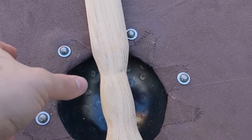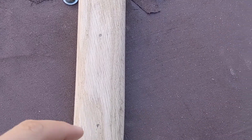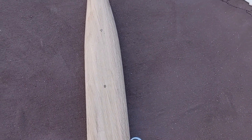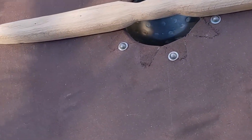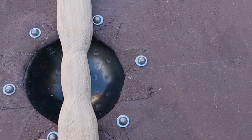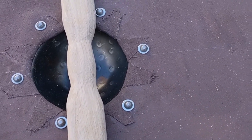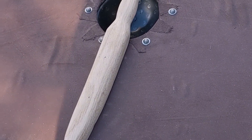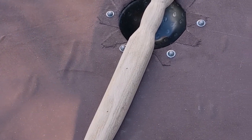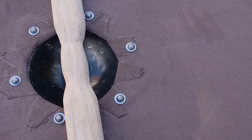The boss itself went on differently than we wanted at first, so it's going to be kind of close to these two rivets to make it go perfectly vertical with the design on the front side of the shield. I have the dots already marked — about three inches there, about four inches there, and the same on the other side. I'll drill the hole and then I actually have a nail that's long enough to put through the hole after I drill it and just gently hammer into the shield, so you've got your place marker for where the holes are going to go. Once you do that, you're ready to rivet — the riveting process is the same as I did on the boss that's already done.